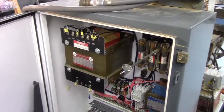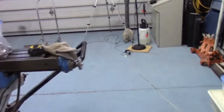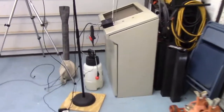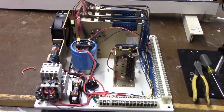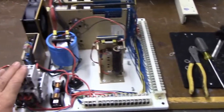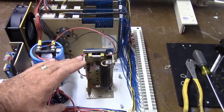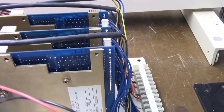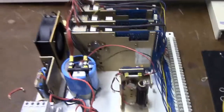All this cabinet has is a step-down transformer to go from 240 to 120, and then another transformer to step down the voltage. Once it's rectified for the servo motors, that's all this cabinet did. There's a shot of the operator's console, and the servo drives and electrics were down inside that cabinet. Here's a shot of the servo amplifier assembly - you've got the power cap, bridge power relay, a surge-type device, and these are Servo Dynamics Model S0152-10 servo amplifiers.